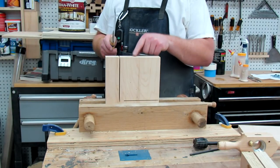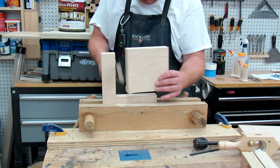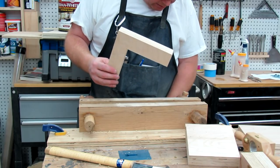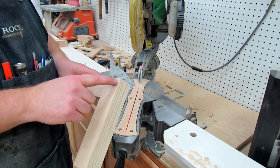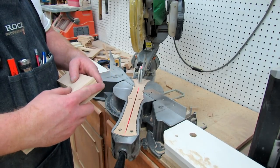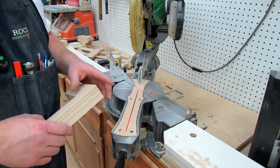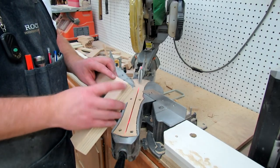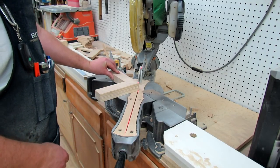Once you've got your right angle cut with the table saw, you're just going to finish it off with a hand saw. Now we have our right angle. The key is you want to make sure that it's a perfect 90. There's one more thing you need to do with the miter saw — trim the back corner off your right angle piece. That will give you a little extra clearance for when two pieces are being joined together, just in case the inside corner isn't dead perfect. I'm just taking off a quarter inch from the point — set your saw to 45 degrees and you're ready to go.